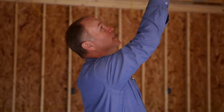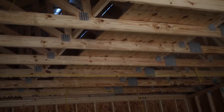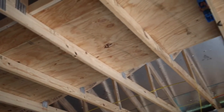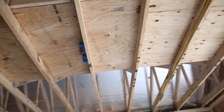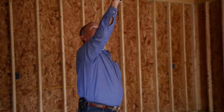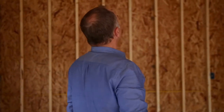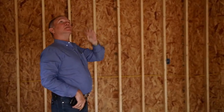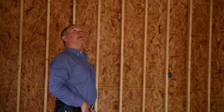This OSB that we see here is also going to be on the outside, and that way the owner has a fully insulated workshop surface. You can see we're putting a little bit of decking up here — we've got one more strip to finish. That's 5/8 decking on top of a 3/4 — I can tell it looks like a 3/4. These trusses were built up heavy so that we could do that. You can see there's a thick bottom cord on there, and this is going to allow for a pull-down stair and good attic storage up there. That may be why they didn't finish it — they want to put that attic entrance right in that area.